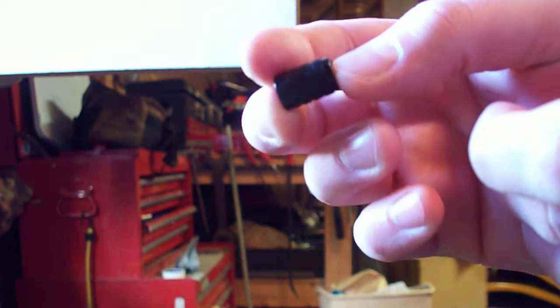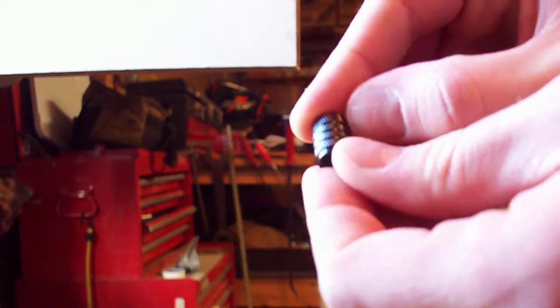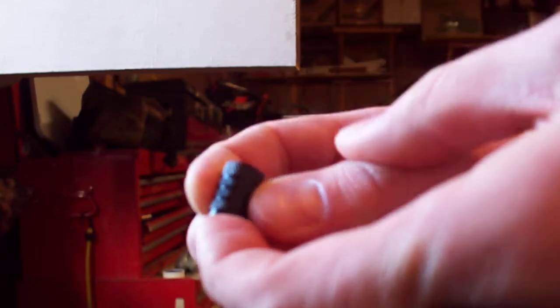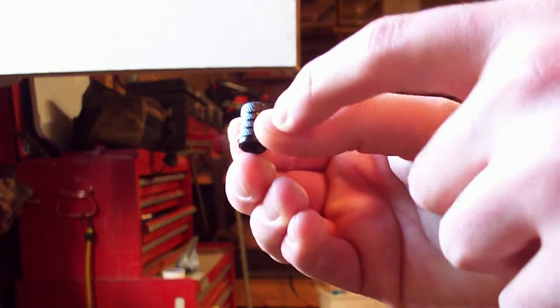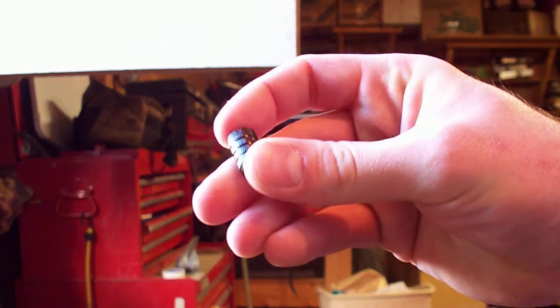Now, in the top two little grooves here, I used my Dremel tool and made notches, just a place that was flat, because it's very difficult to drill on a round surface, as you probably know. I made two of those in four places, 180 degrees from each other all the way around. So I gave myself a place to have 8 holes in the outside, 4 on each ring.